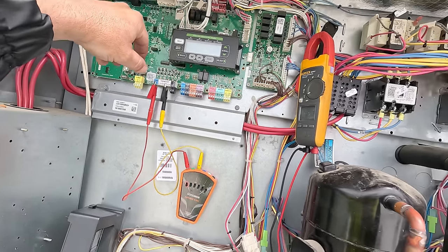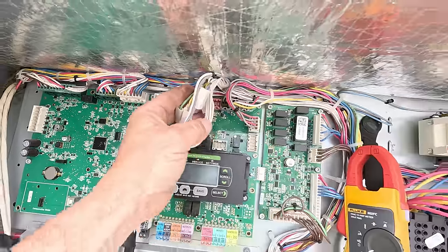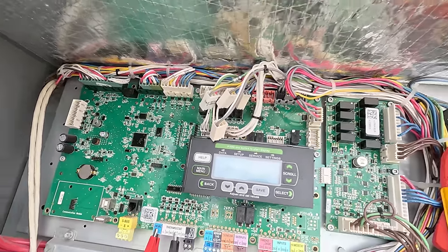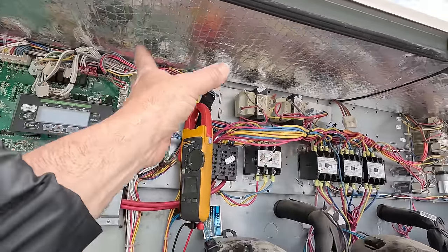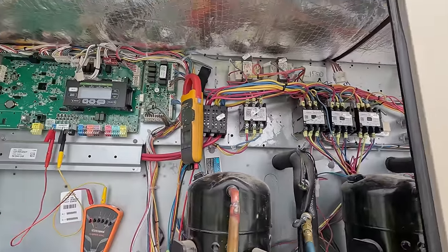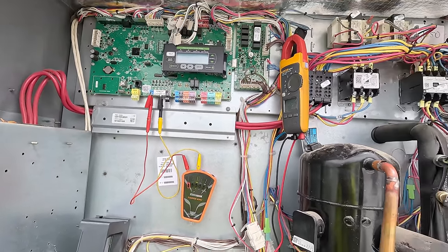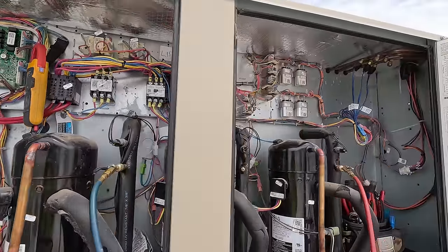Made it simple. And then he had me unplug all my outputs up here on this very top board, which is the P265. I took a picture ahead of it because I have a feeling these could be switched around in different orders, so we're going to look at the picture for that. And so that's all your output. Basically he did exactly what I was doing by unhooking it at the contactors. However, by doing it there, he's isolating it from a possible short in the frame and stuff like that. So we ended up jumping it at R to Y and it still did it. And he said, hey, get her out of here. So we're going to get the information together and have them quote the board, and they're going to be warm. There's nothing we can do about it.